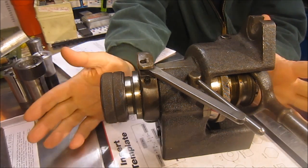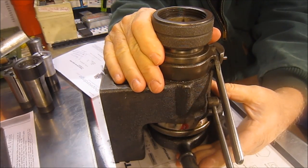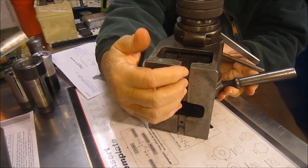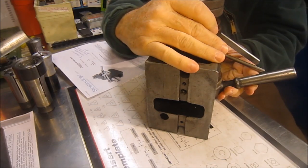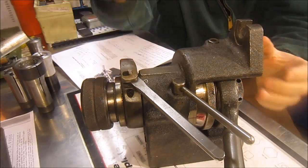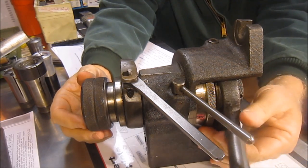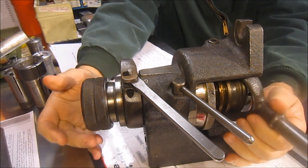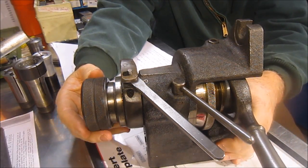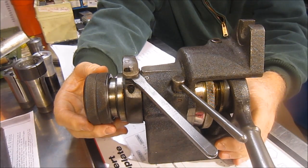It is a horizontal or vertical fixture — it will work in either method. The unit has the ability to take keys so that you can line it on the mill table quickly. The lever closer is for the 5C collets. The actual handle has a hundred-to-one leverage, which is really quite strong. The unit is designed so that it can be operated with one hand as you index.